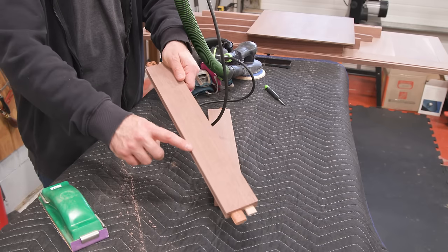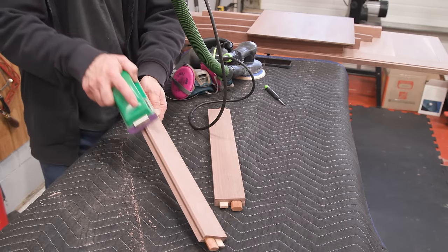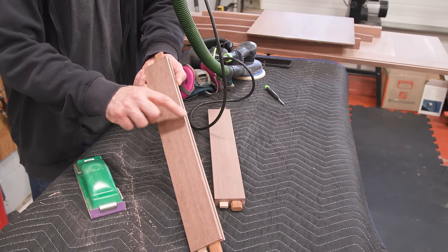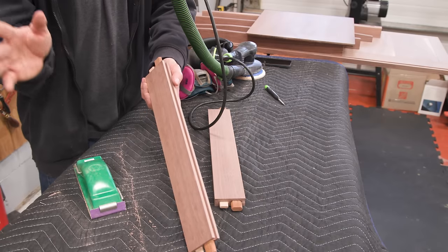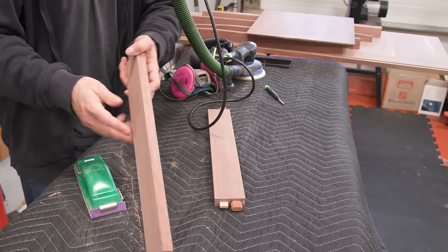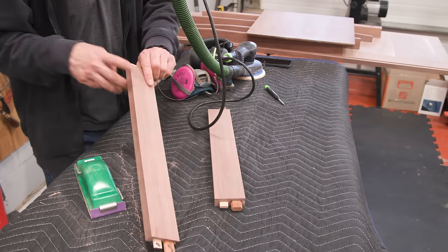On the rails we have a similar issue with softening. The outside face of my rail — we're going to have a setback where it meets the panel, so that outside edge we can ease now. On the inside, it's a different story — we have a flush fit with the panel. You could technically round it over, but I recommend you don't, because if you have a nice clean transition between the rail and that inside piece, it just kind of disappears. This is super important: know which surfaces to round and which ones to keep crisp. At the top of the rail, we're going to have a web frame meeting here, and on the outside surface an overhanging top — neither of those are candidates for rounding over.